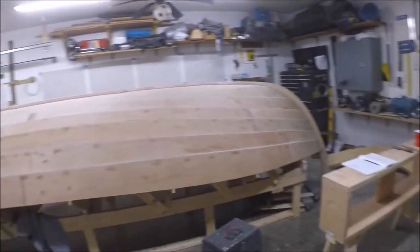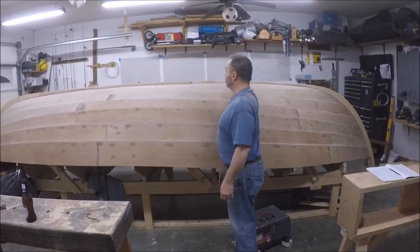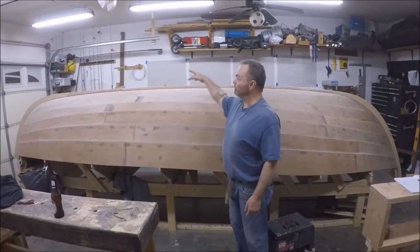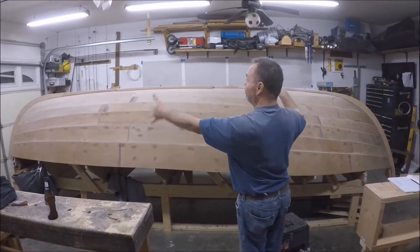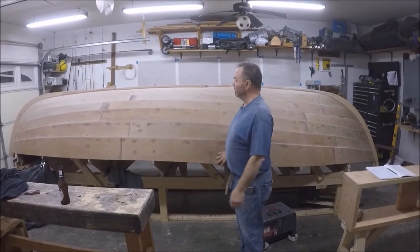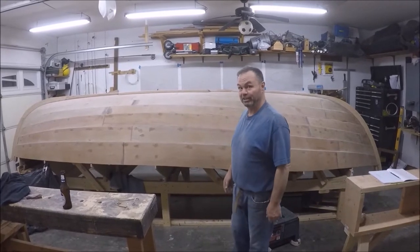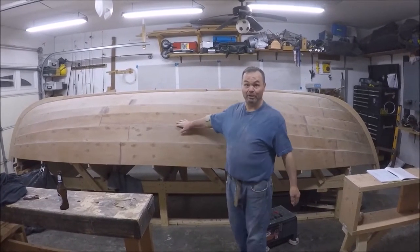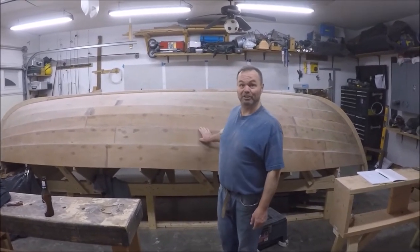Kathy, hello, and Jenna — these guys are ready for bed and I called them out here so they could shoot a video. I got all the filleting work done along the bottom keel, and it's sanded. I got the profiles kind of where they're looking about half right on each end. I filled all the nail holes over and over again — they keep popping up like mushrooms — but I think I've got them all, though I'm sure as I start putting the coats of epoxy and later paint I'll find some.